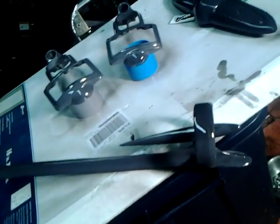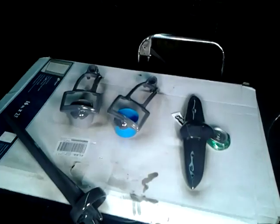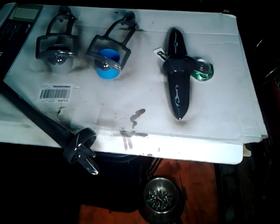I just got a couple of spots — there's a little dry spot right here. They said it might alligator a little bit, but it should straighten itself out. We're gonna wait and see. I'm gonna put the lights on it because it's supposed to get down to like 32 degrees tonight, so I'm gonna put these lights on it right now and let it finish curing off as much as it can before it gets cold.